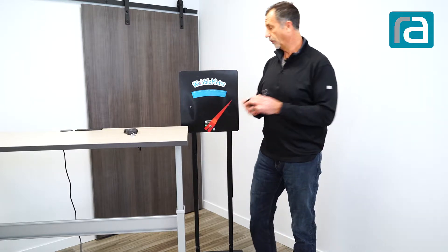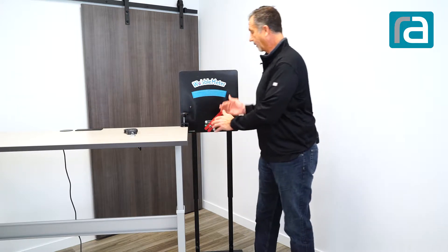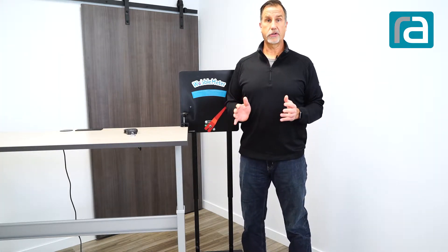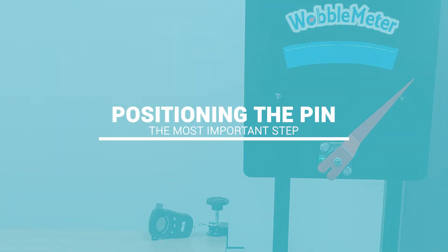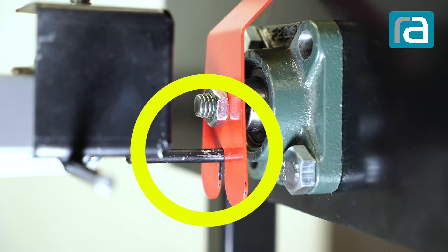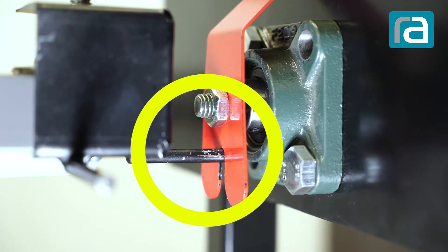This steel pin fits precisely in the gap on the bottom of the needle. When we take this unit and attach it to the corner of the workstation and lock it down, we can take the needle, slide it over the pin, center it, and when we put our movement on the table, it gives us a precise measurement on the display. The pin is inserted into the needle with very little play between the top of the pin and the bottom of the needle. When I move it back and forth, there's no friction — it's not touching. But when I wiggle the table back and forth, you're going to see the movement easily on the needle.